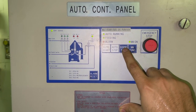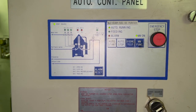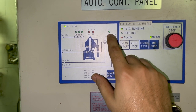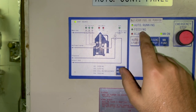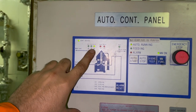Now we press the discharge button. This is a manual discharge. Once you press the discharge button, you will see a series of actions take place. Immediately, the feeding has stopped. Check the LEDs — SV4 is now on. So the indication is on, feeding is stopped, auto running is active, and the purifier motor is running, though purification is not happening.